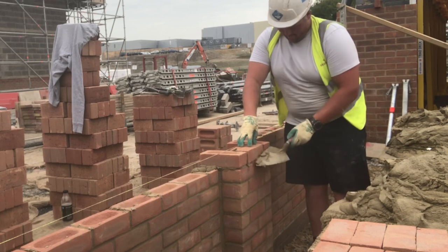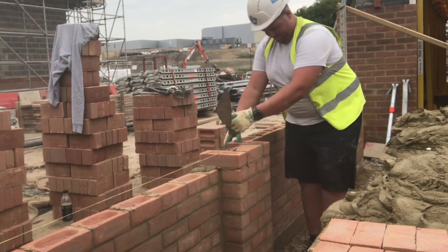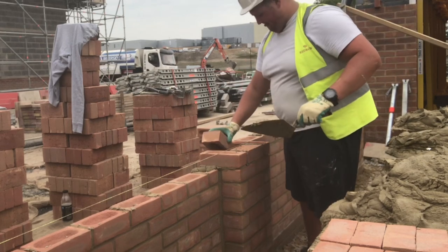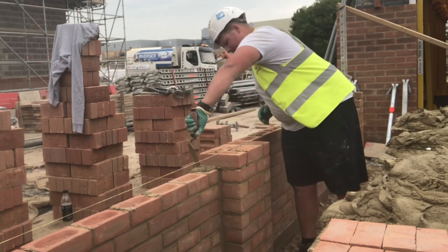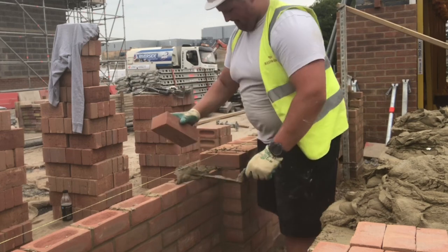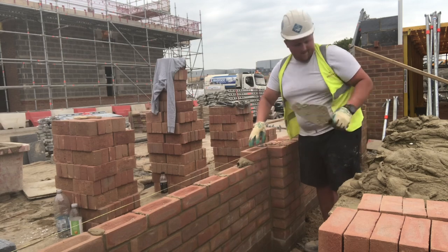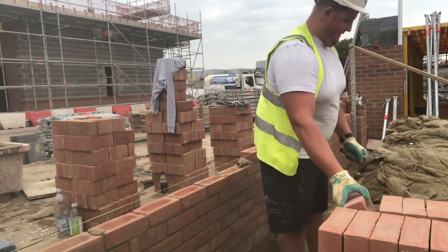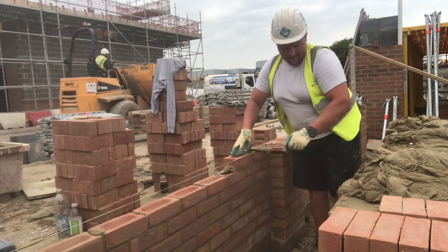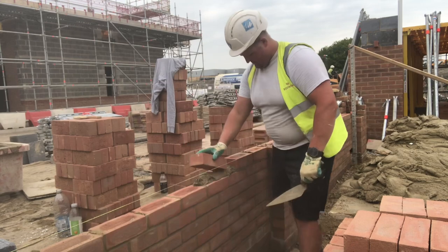You're running your fat in first — it's unavoidable. You've got your pillar in the middle and you're moving your line up at each side when you get to your pillar, because the corner blocks are on the inside of the profile, not the outside. Then you're racking your pillar back — I built like six bricks around my pillar and then started racking it back. First thing this morning I got so many courses up with a little mini corner, tailing out up to the pillar, then racked all the way back.